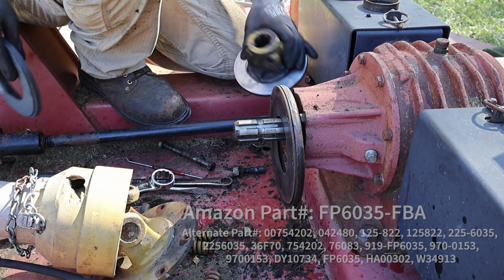And what we need to do now is we need to torque these bolts down. And essentially what we're looking for is the distance of this spring needs to be basically 33.6 millimeters, which we're gonna use a micrometer. And we're going to set this to 33.6 millimeters. And again, this is found online as well. We will try to link where we're getting all this information so that everybody kind of has it. I'm going to just basically bring that in here, and we're going to check this spring all the way around as we go to tighten this down. And each one of these has to be exactly the same.